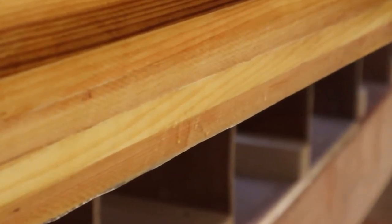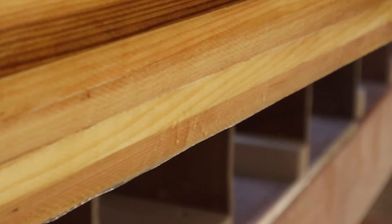Those would be covered by the gunwales but I'd rather have them better. So I'm going to start the sanding process here and see if I can smooth this off enough that the weave doesn't show through, or if the weave starts to show through as I smooth it off, in which case I'll need to apply more epoxy.